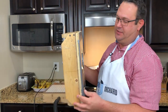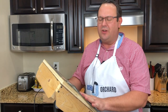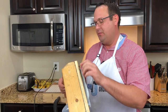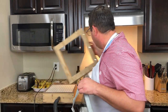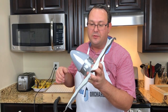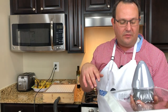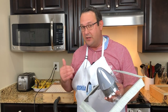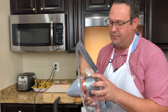Yeah, it's perfect — it's absolutely perfect! So this is then the fun part. It's in the mold, it's still kind of warm but not hot — cool enough that it's not going to change anymore. When I have a successful pull, I try to leave it in the vacuum long enough that it's going to cool down a little bit. This is amazing — absolutely amazing. There are no ribs or anything. I got the temperature just right and I got the vacuum right. Having the vacuum on to start, I figured I'd need a stronger vacuum pull at the onset because I didn't let it sag as much. Trial and error — we're getting it!